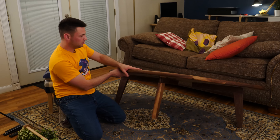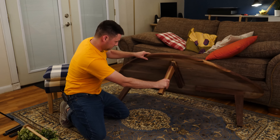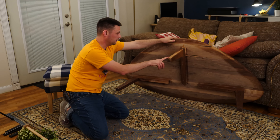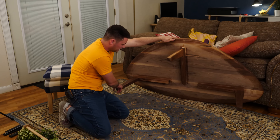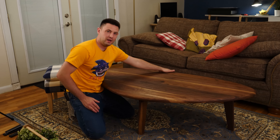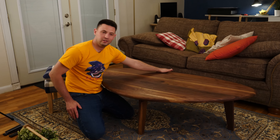The leg spacing — as you can see, this leg's fine, it's in a good spot. These two legs are perfectly perpendicular to this leg, which is maybe not the most ideal. At the end of the day, I probably should have canted these legs out. If you were to step on this table and step on the backside, you would easily fall over.